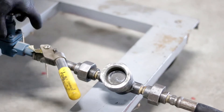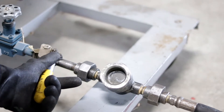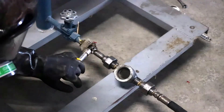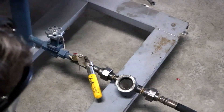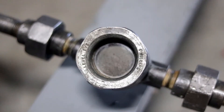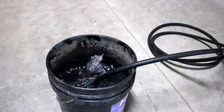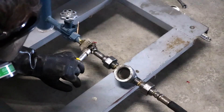Step 6. Crack the system oil drain valve and open the spring return valve until oil starts to flow. Step 7. Continuously monitor the flow of oil. Open the system oil drain valve more if necessary. Step 8. Watch for the appearance of ammonia. It can be heard spitting or popping and observed by the line getting cold or icing up.